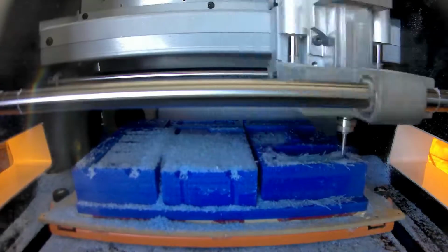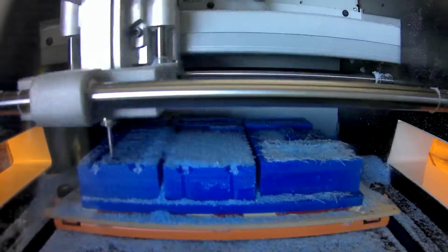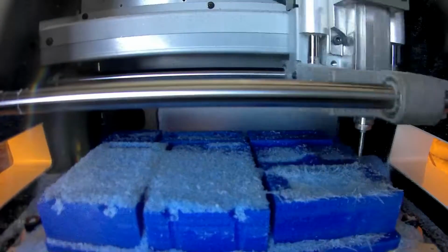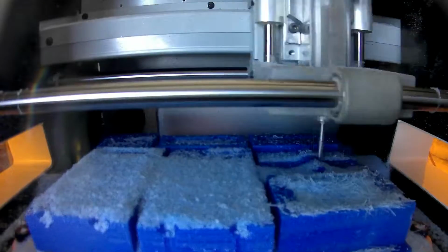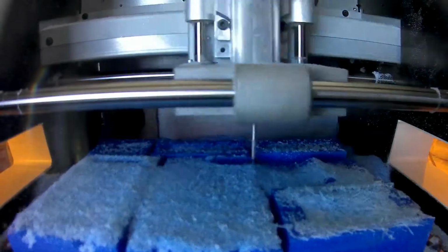Interesting to note the shavings that are occurring here. That's an issue to do with the waterline cut being rough and then doing an XY cut as a finish. There's always a little bit of full height cut on the tool there if you do it that way, so you've got to be a little bit careful about how you use that tool.